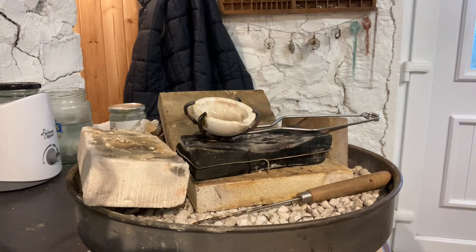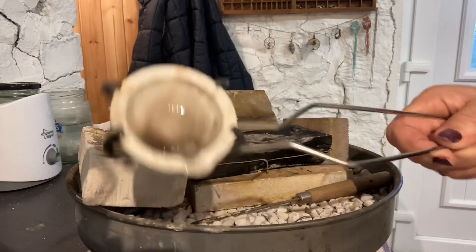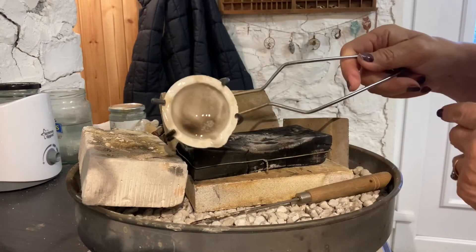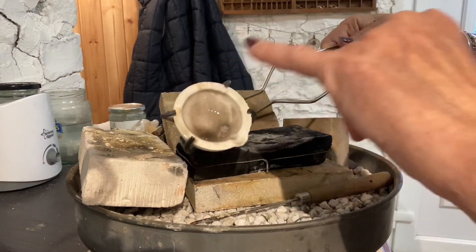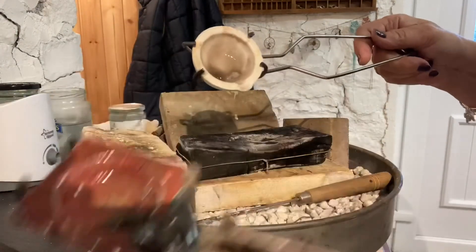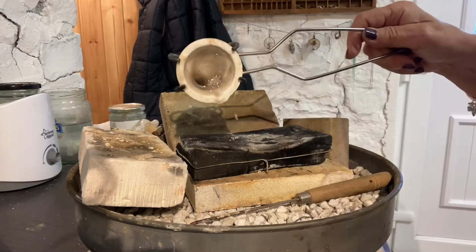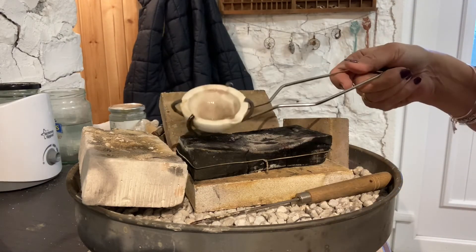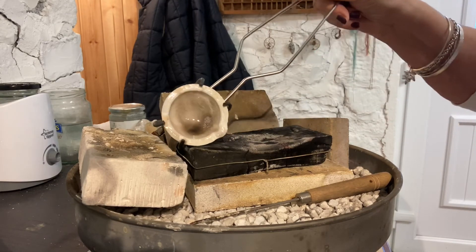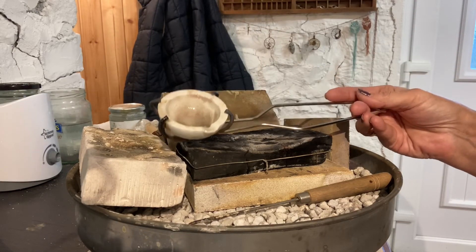Okay, let's have a look at this now. I think that's done the job. As you can see, it's all shiny — some of the edges are shiny, which is what I wanted. That will all end up like this eventually. There's probably a bit of excess borax in there, but that's fine. Next time I put my gold in I'd need borax in it anyway. So I'm happy with that — nice, shiny new crucible ready for the gold.